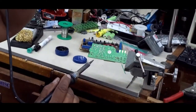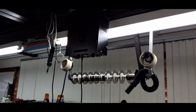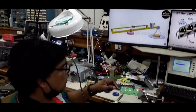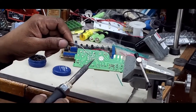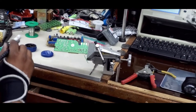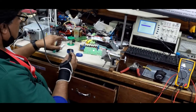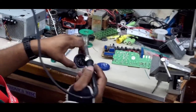We will try with the solder. This is the solder there. That's the stack array of solder that we have there, in which they come in different gauges. Okay, and here I go. So I'm just going to try it, making sure that it has a shiny look. Anytime it's black, it's impure. It clearly shows that we have not taken out the majority of the impurities.